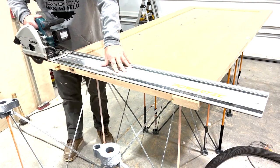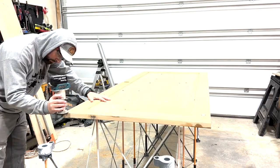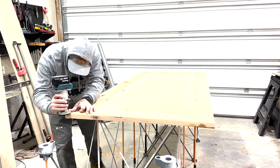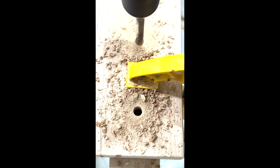This part of the process is so much easier with a track saw, but you can do it with a circular saw on a straight edge. Now that our door is finally at its final dimensions, we're going to knock down those super sharp corners — I prefer a round over. Last but not least, it's time to drill some holes for the hardware. A little tip: if you start with the drill in reverse, you can avoid tear-out on the top.